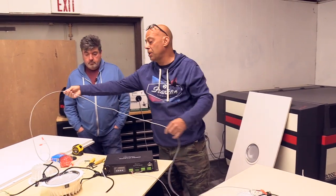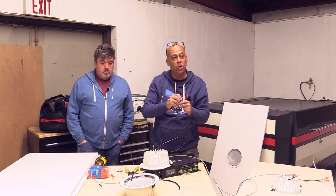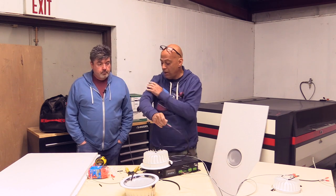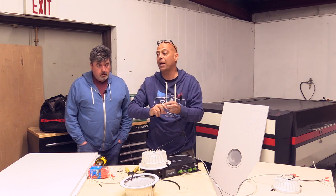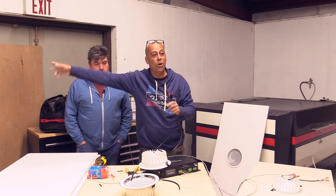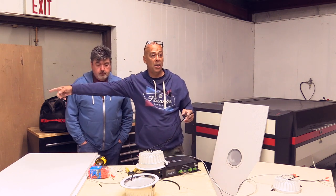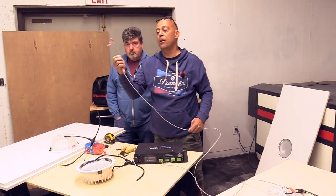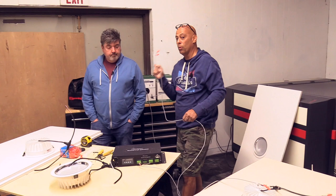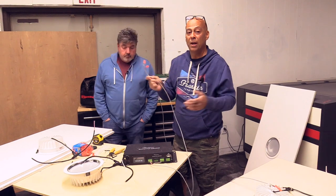Now we throw across to the next light. When I go to the next light, I start first on my next run. I wire that up to do my connection. Remember, this light is not on yet. I throw that cable to the next light. Now I connect this to the previous. As soon as I connect this, now I've got two lights that are on. My wire is hot, ready for the next one, and it is ready to go because that wire has already been stripped back and has the wire nuts. This goes really, really fast when you do it that way, and you don't have to go back if you're setting up scaffolding or high ladders.